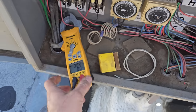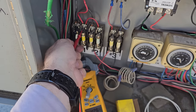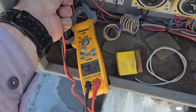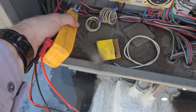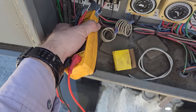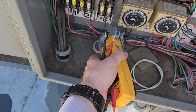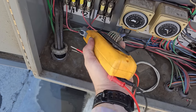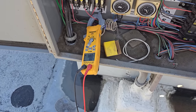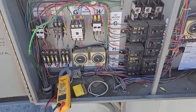Let's get in here and also test voltage to make sure we're delivering the right voltage. We're delivering 205 volts. The other motor I tested is running 3.7 amps. Those should be the same motors. My guess is going to be it's a capacitor issue. So what we're going to do is shut down the rack, put gauges on the walk-in freezer compressor, and equalize them out.